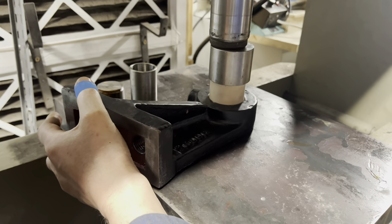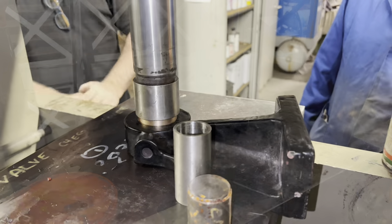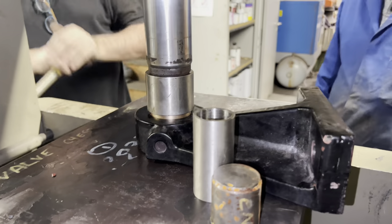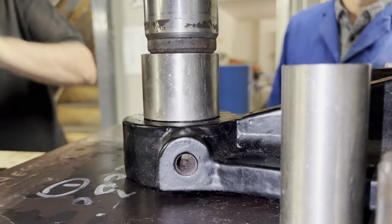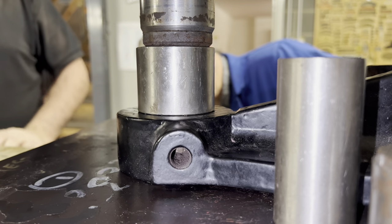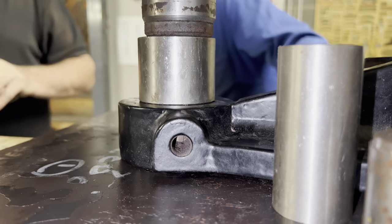We've done the same trick here as in the previous video — we've put the bronze in the freezer, which you can see has a slightly frosty colour, just to cool and shrink it down a couple of thou to make it easier to press in. As it warms up it expands, so it'll have a really tight grip in there. You can see we're putting around about ten tons on there just to push it down flat. The motion bracket has been restored a little more here — painted black in its final coat — and its base was skimmed so it'll lie flat on the surface of the actual motion bracket on the side of the locomotive.